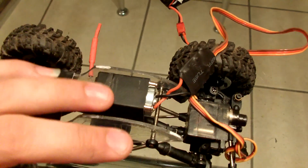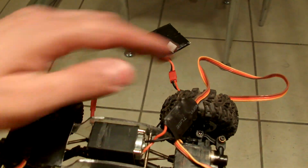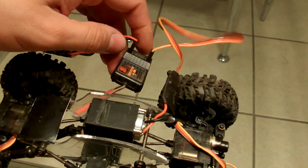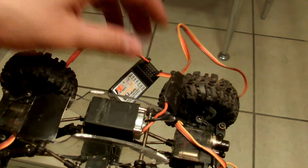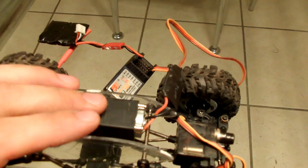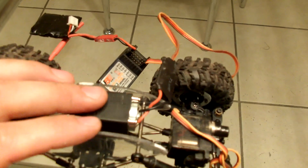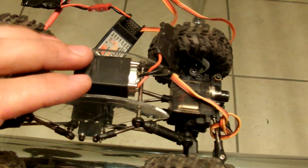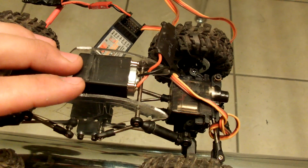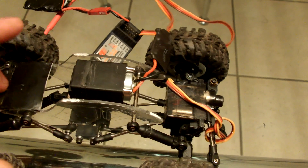The reason for that is a ridiculous amount of power, which I'll be able to control because the receiver is the one that's going to be supplying the power. These receivers I've run with up to all six channels at the same time, just to test if they could handle it — and that's all six channels running big servos like this one. So I'm going to have two of the big servos, hopefully 250-ounce torque, side by side — one for the front, one for the rear.